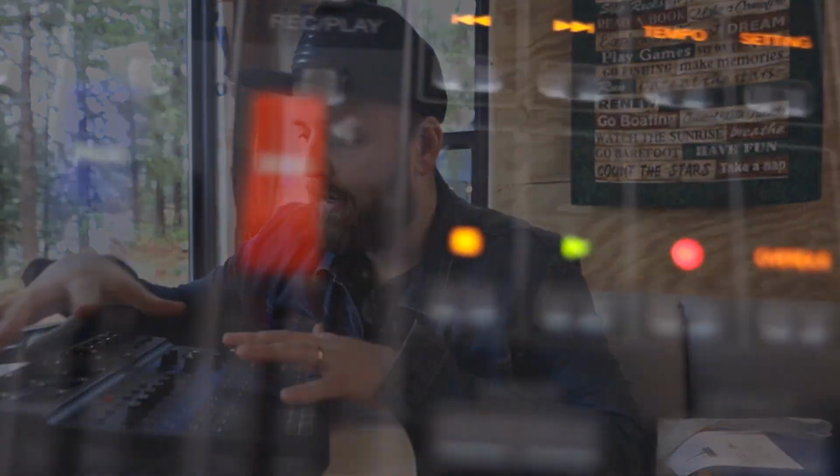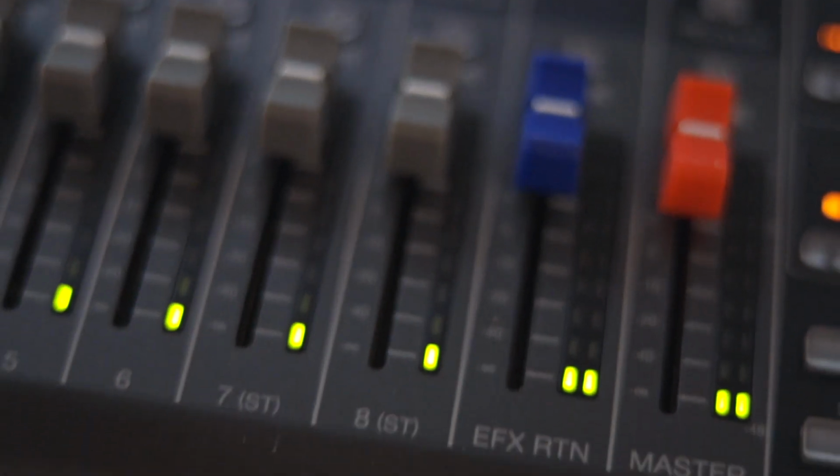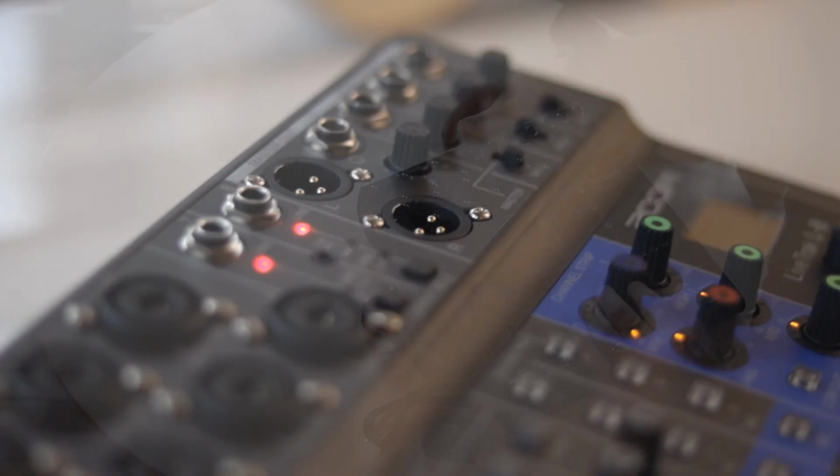Whereas this thing will record every input, including the computer, as a separate track to separate files. So you can go back and mix them later or take out things later if you want. And it will also make another stereo track, just everything mixed together, however you have it mixed here. So if you get your mix right and you like it as you do it live, then you don't have to go back and edit everything together and make everything line up. You can use that stereo output just like a normal mixer, a normal 2-channel recorder. Or if you say, I want to have the control of being able to take out certain sounds, turn off the bass track later when I don't want it going in, you can do that because you have all of the inputs separately. So this thing gives you really a lot of control, as well as it's got a bunch of the normal mixer stuff in here.